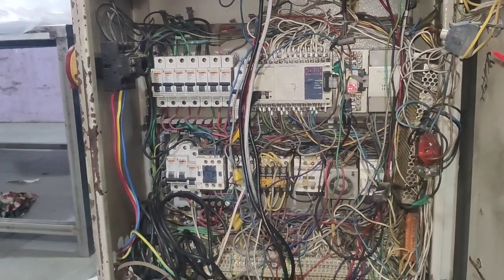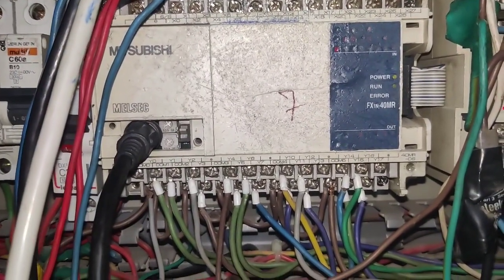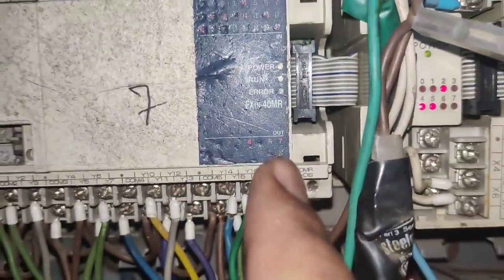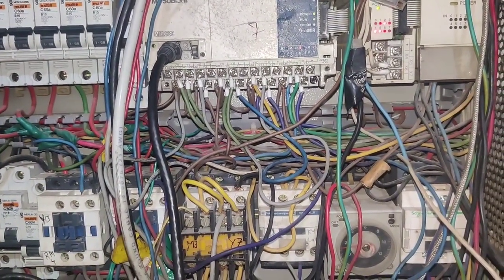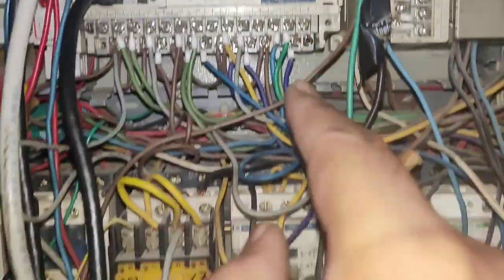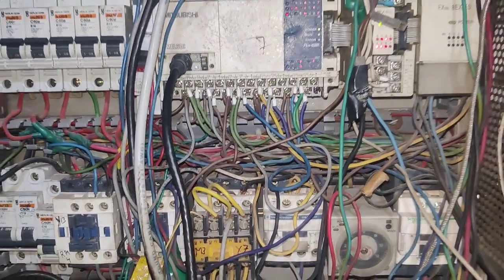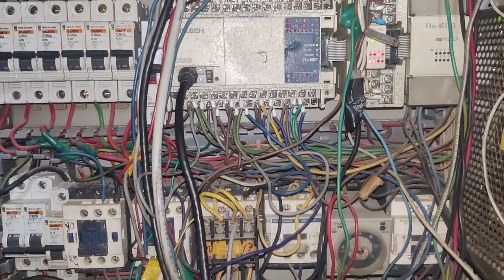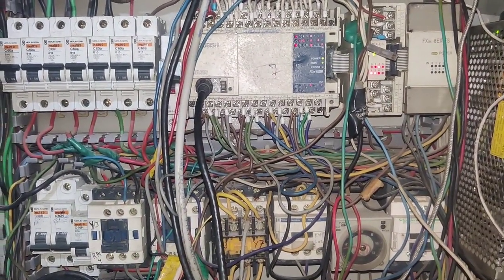Machine is starting. You can see input is showing. Now first we will see after running PLC, when 7 number digital output is coming, contactor is operating or not. Now contactor is operating. If your indicator is blinking, that means 7 number digital output is coming. So first you need to measure voltage in Y7 terminal. If voltage is not coming, that means your problem is PLC internally. If your Y7 number terminal voltage is coming, that means fault is in your wiring — you need to check wiring of your machine. Because in this condition, Y7 is coming and now contactor is operating. If your contactor is not operating after 7 number terminal is active, your problem is PLC internally.